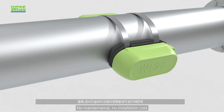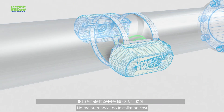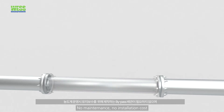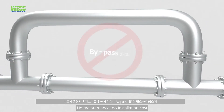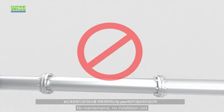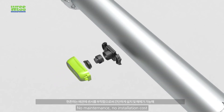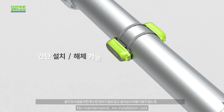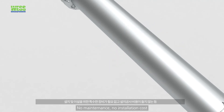The second feature is no maintenance. As the clamp-on type sensor is free from contamination on the sensor surface, frequent sensor cleaning is not needed. The clamp-on type density meter does not need an additional bypass pipeline, which is essential for insertion type density meters for sensor maintenance.